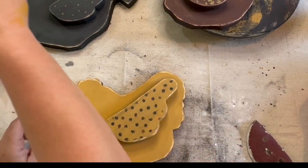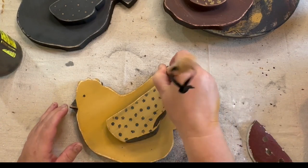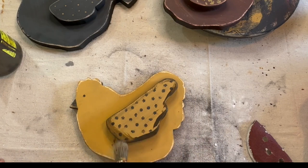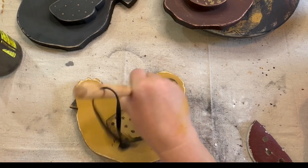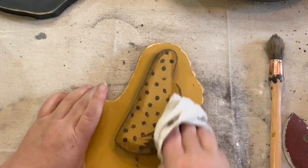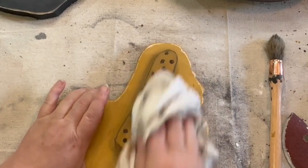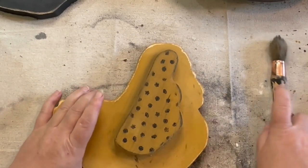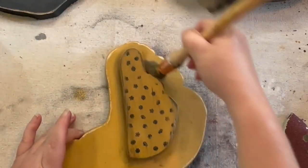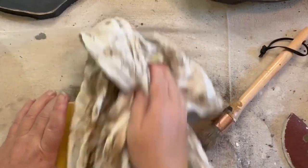Now that the backs are dry, I brought them in and I'm going to take my antique wax, water, and black paint mix and brush that onto the edges where my raw wood is, then wipe that back. It covers the whole wing but I'm really focusing on the edges to get that stain right in there. You can see there's a little bit of darkness — that's what I'm looking for, just to outline those edges. All those raw edges are going to get some of this darker stain.